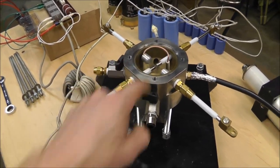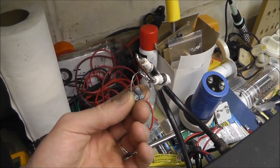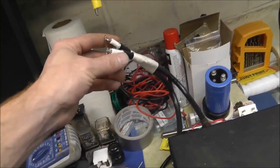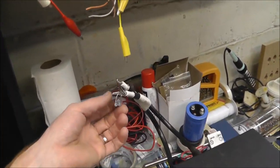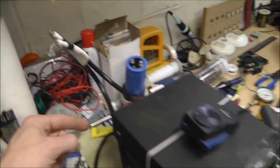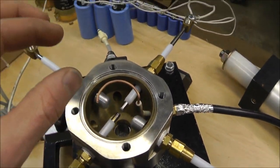And basically what I want to know, what I did here is I took some 2-watt resistors, two of them, 100 ohms, and put them in parallel. So I've got a 50-ohm load, okay? And this 50-ohm load allows this radio not to blow out the finals in it, okay? So basically, I'm still radiating the frequency on this coax cable, which runs over here and runs up into my cell. So this wire should still be resonating, but it's not.